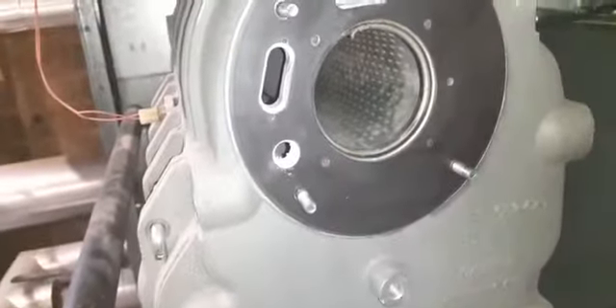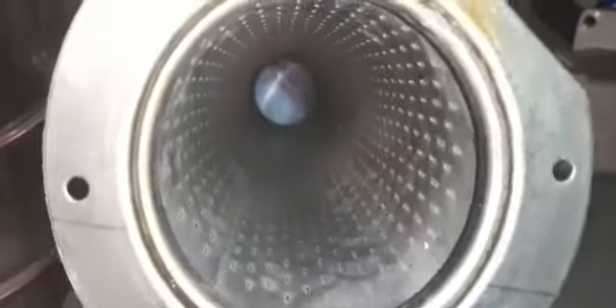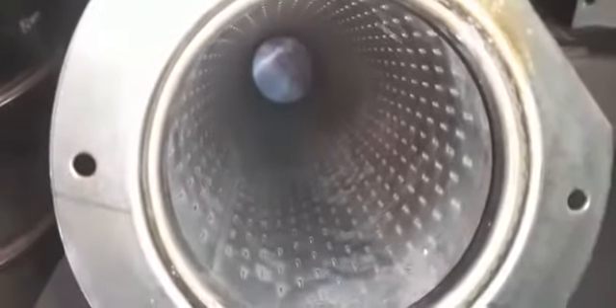Making sure the probe gap is correct and cleaning them up with a file. I couldn't help myself — taking the burner out. Going to give it a gentle clean because the fabric is very delicate. I'll wash it down, go to the van for my brush, and give the inside a brush down as well.